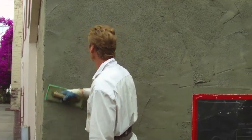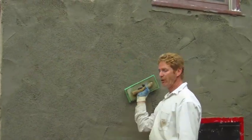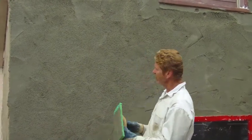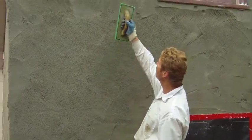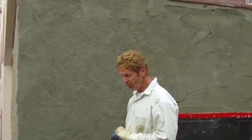Because this has been painted so many times, after I'm done with the float, I'm actually going to hit it with a hard rubber float to get rid of some of the grains, because this is what they had. But if you paint this — as opposed to already having 10 coats — I'm not going to match it perfectly tight, but I'm going to try to get it as tight as possible.